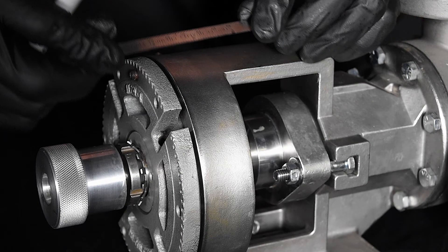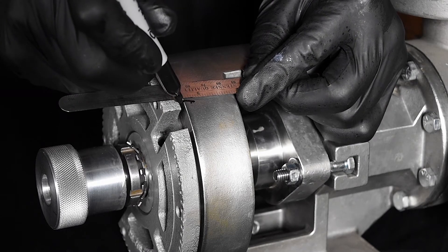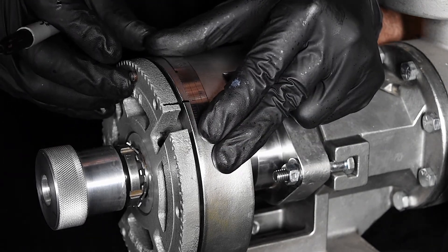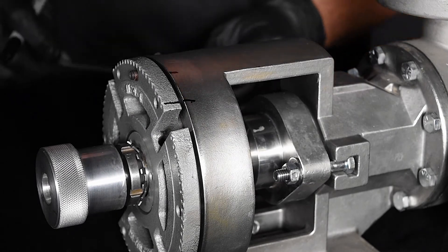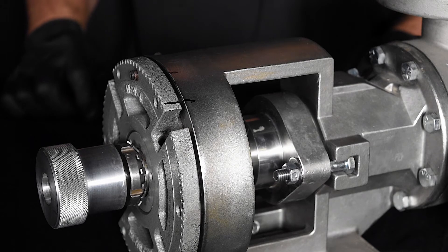Make a continuous line on the bracket and bearing housing outside diameter to mark the zero clearance point. This will be the reference for zero end clearance. Make another line on the bracket by measuring the correct length from the first line on the bracket based on the size and clearance of the pump. The correct length can be found in the end clearance setting table for the appropriate size and material of pump. This second line will always be made to the left of the first line when looking from the shaft end of the pump. The pump shown is a G14 model size stainless steel pump and an A clearance setting adjustment of 1.12 inches has been made.